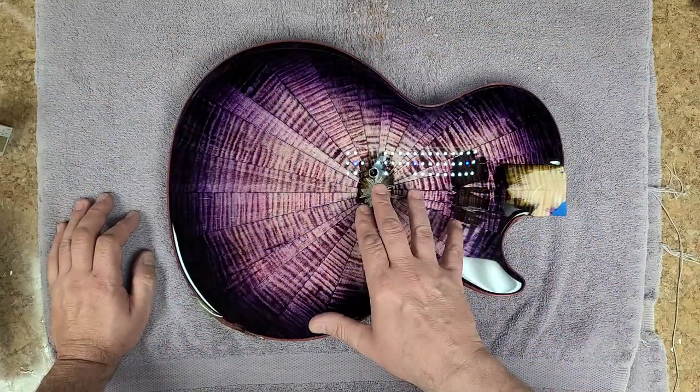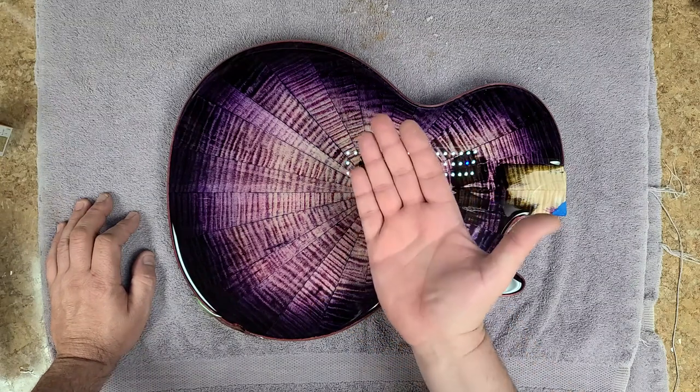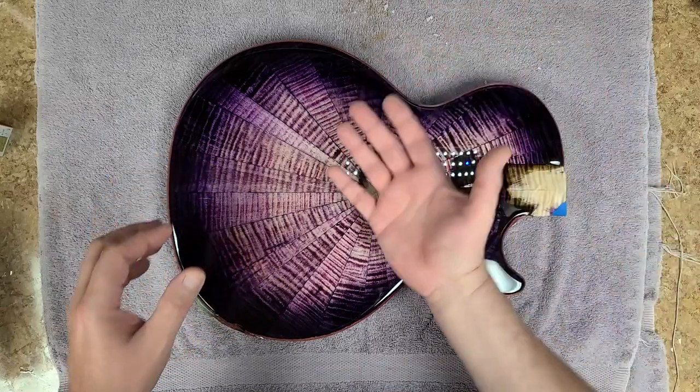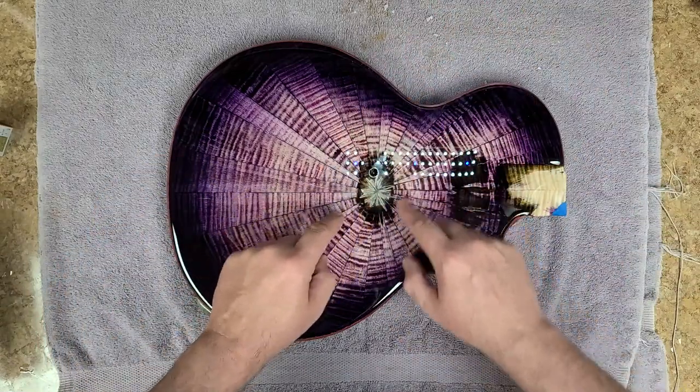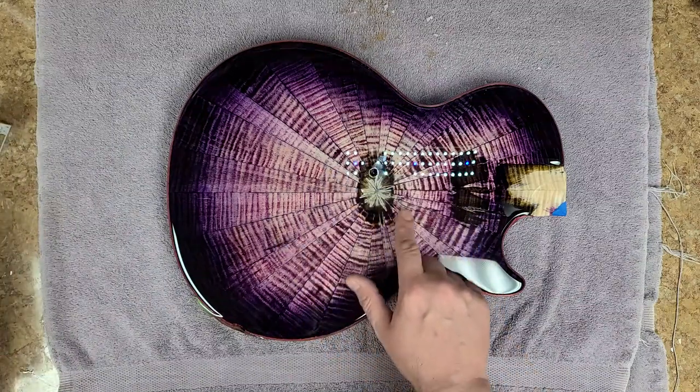So when I put the foam rubber inside of here, that kept the veneer upward, so when I did the vacuum bag, it didn't get sucked down and stretch out all the sides over here where the veneer is messing up the way that it looks over here.